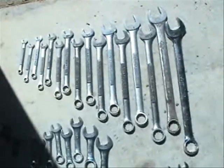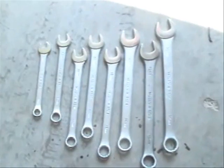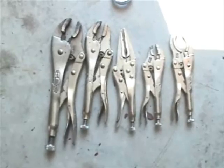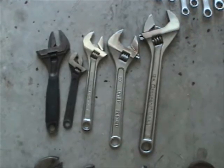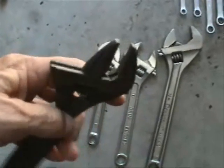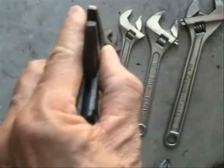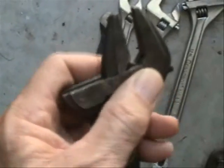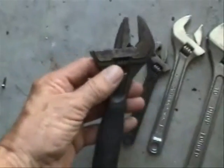Open and close wrenches — we have long and stubbies, and don't forget the metric sizes. Also a good collection of vice grips, adjustable wrenches of all sizes. And this one, my viewers, is to remove the powerheads on large TXVs. It's necessary to have a narrower than usual wrench for removing powerheads on TXVs — a must-have, by the way.